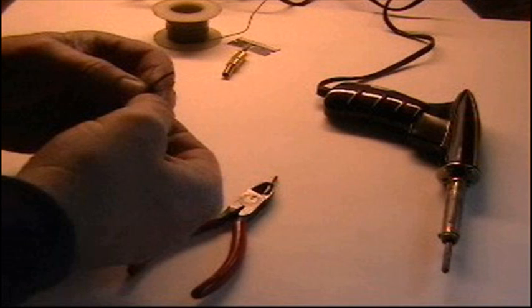There's also a couple of third wires. When I say a couple of third wires, I mean two different strands, but these are not coated. They have no insulation on them at all. So the first thing you want to do is strip the insulation off the end of those that are coated. That is probably, and I say probably because the colors could be different, but most often the green and the red wire, so that you have some wire exposed that you can then hook to the plug itself.